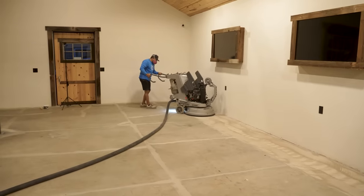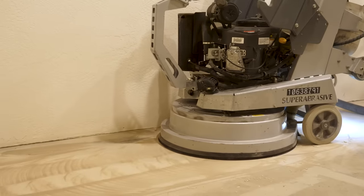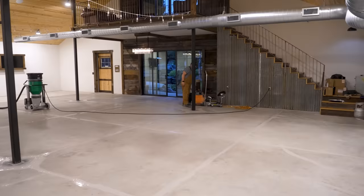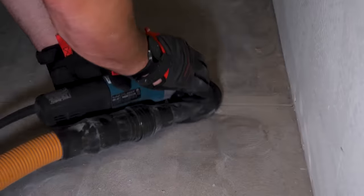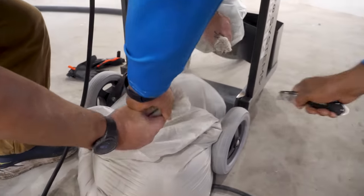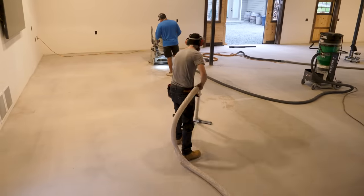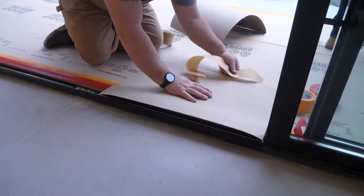As you can see, I'm using the grinder — we're grinding the whole entire floor with the big walk-behind grinder. We use the four-inch grinder to go all the way around the perimeter because the big walk-behind grinder can't get up to the edge. We did the same thing around all the posts. We just finished grinding the floor, cleaned up, everything looks good. We finished dressing all the patches, and now we're going to do the moisture seal.